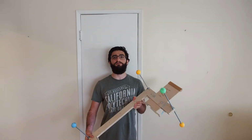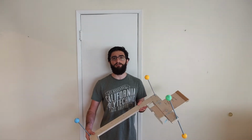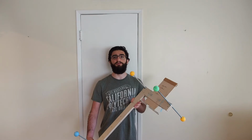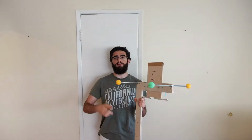I've made an assembly fixture to help Lepton systems assemble their PCBs. In this video, I'm going to show the different features of the fixture that simplify the process of PCB assembly at Lepton systems. The most notable feature of the assembly fixture are these long legs that have these balls at the end. This allows the assembly fixture to be rotated in 5 different directions and placed down on a table in a way that still allows access for the PCB to be worked on.